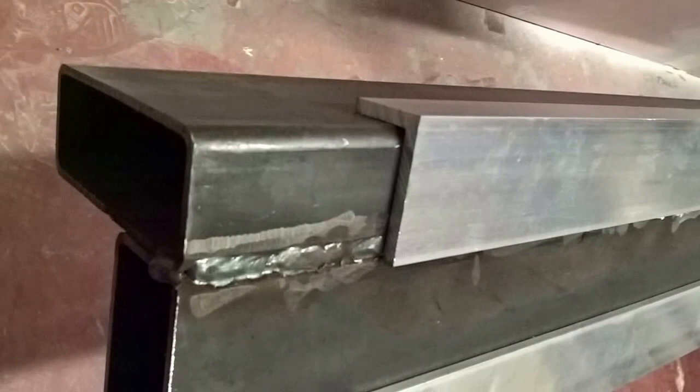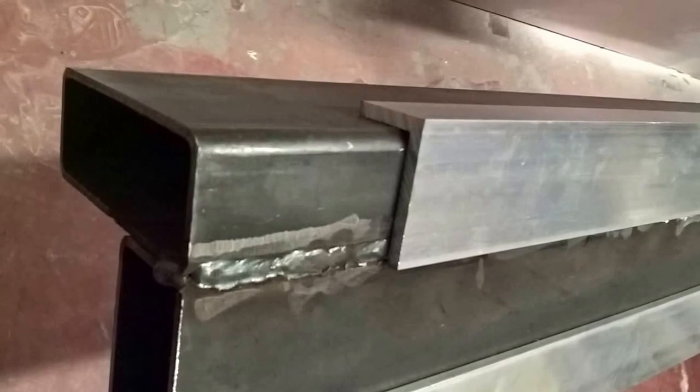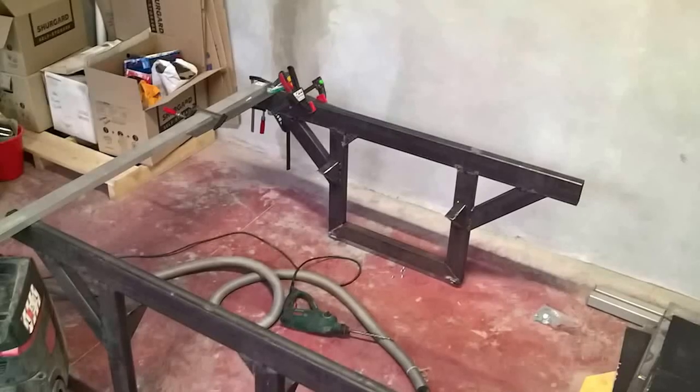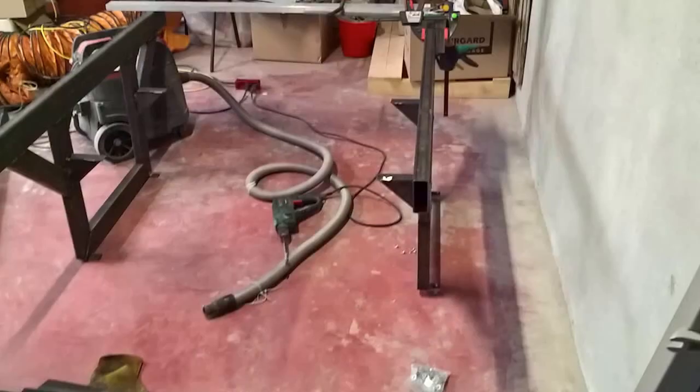Because it pulled so much it was almost square, but almost wasn't as well. So what I did is I took aluminum L profiles and I glued them on top and very lightly clamped them, and that allowed me to relatively easily square up the gantry. Here you can see a few pictures of the frame being set up in the workshop.